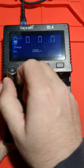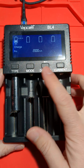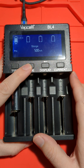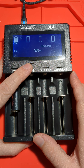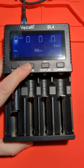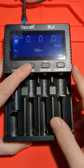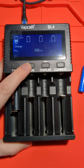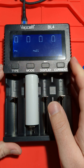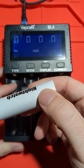Let's do a quick overview of the different modes. In pro mode we can change the battery type — it's detected NiMH here. The available modes are: test, storage, discharge, and repair. With repair mode, if a cell is at a really low voltage like two volts for a 3.7V cell, you can try to bring it back up using a small current. It won't work all the time — a truly damaged cell just isn't going to recover.